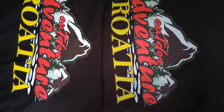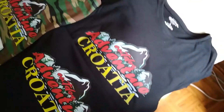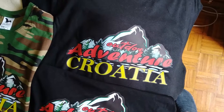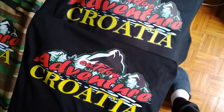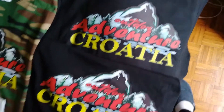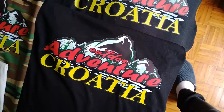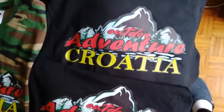There's not a very big difference, but there is certainly some difference, and the white is also more intense. You can also regulate this if you have a thicker white under-base or over-base when you print DTF, and maybe a little bit more black to get this result. But both of these images are printed with the same percentage in the RIP — the intensity and vibrancy difference comes only from using different powder.